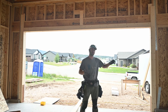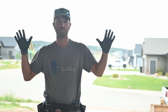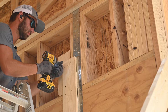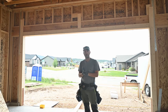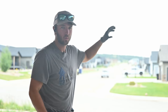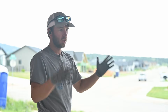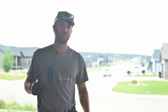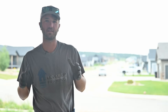That's how you install the perimeter around the garage door. This is way stronger than if they just put their garage door rails right on the drywall — it's going to last a lot longer and look a lot better. We went ahead and added in sheetrock backing around our two side boards there, which just makes it easier to drywall around those. One last thing: if we're doing this out of two bys instead of one bys, we'll usually try and put a two by eight or a two by ten on that middle board — just a little bit beefier, gives them more meat to screw to. If you guys got any value out of this video, be sure to subscribe to the channel because we're doing an in-depth video on every skill it takes to frame a house.